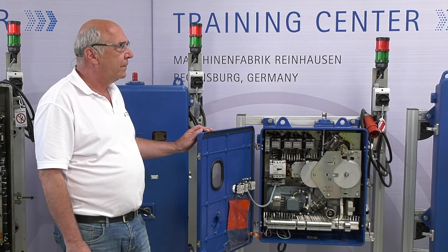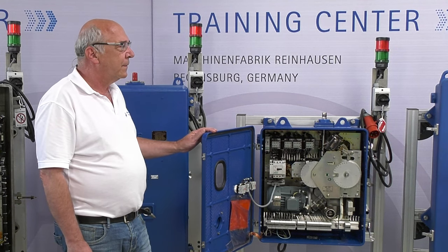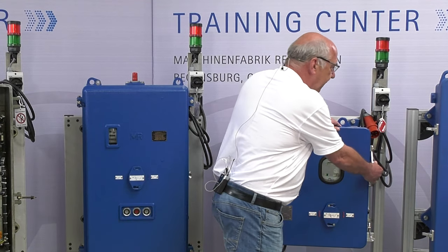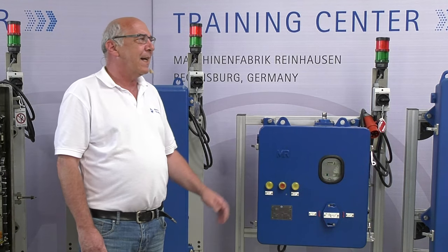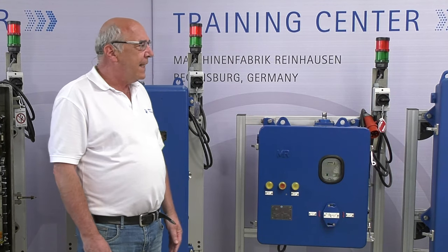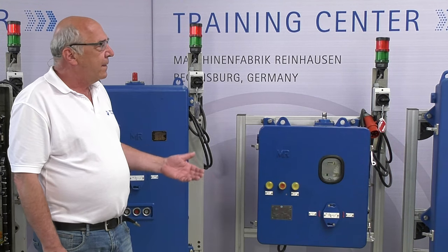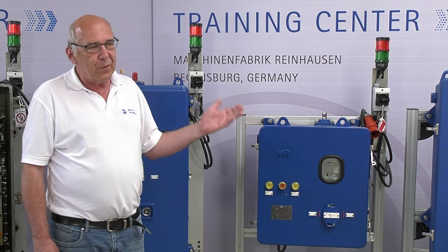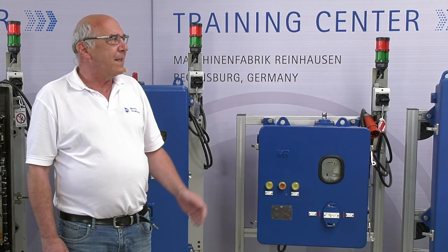Last but not least, we see the TAPMOTION ED, our current motor drive unit for on-load tap changers. I think it has been manufactured since the year 2000. They started with the first units around 1998-1999. But in the year 2000, the TAPMOTION ED replaced the MA7 and MA9. The benefit of the ED is that it has run-through protection. If there is a motor relay or something sticking, after one operation it will automatically trip the motor protective switch.